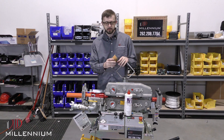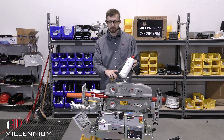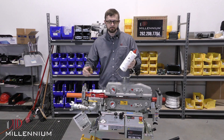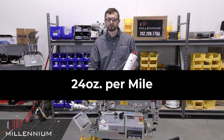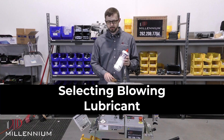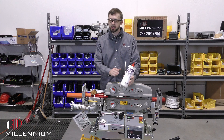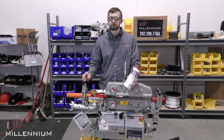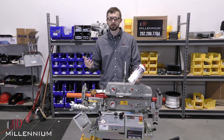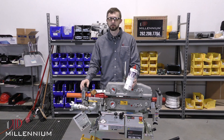What we'll do is use a little bit of lube. It's recommended about five ounces for every thousand feet. If you're trying to blow a mile, that roughly translates to about 24 ounces. Now selecting your blowing lube — you cannot use pulling lube. Pulling lube is water-based; once you start adding air to it, the water evaporates out and you're just left with a sticky substance that lines your duct and makes it impossible to blow.